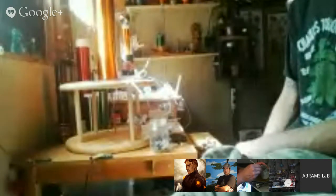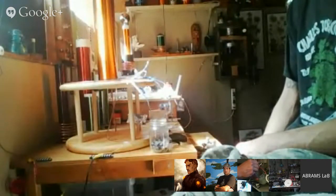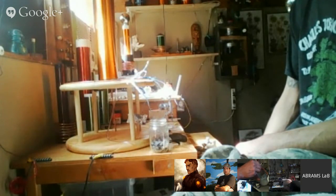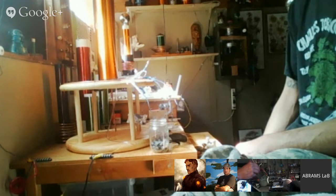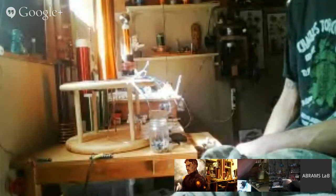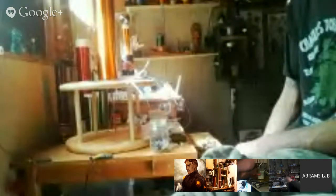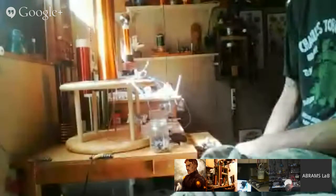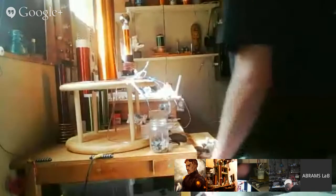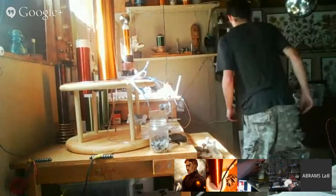Yeah, you've sent me transistors. Are there transistors that can handle that copper? It depends on how thick the primary is. I've run Slayer circuits on the Tesla coils, and it does work. The transistor gets kind of hot. I think it's just how thick the gauge wire is in comparison to a normal Slayer primary, up and down.